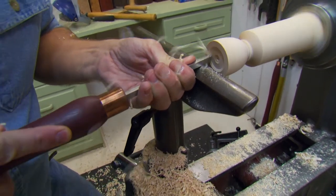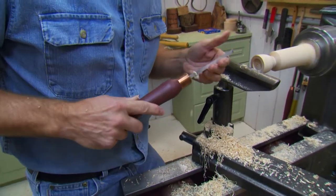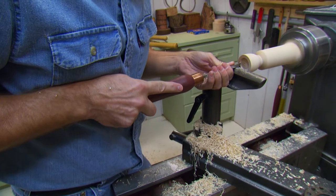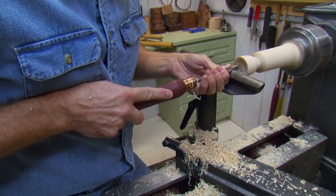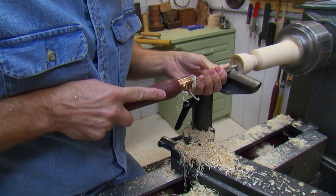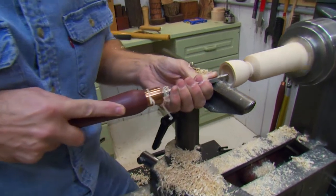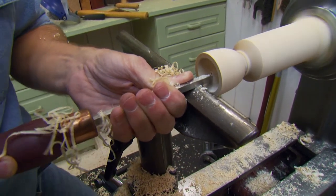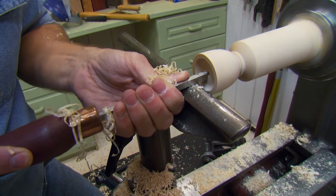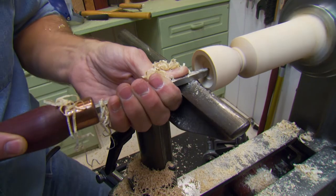If they're making it for themselves, make it one inch and one-eighth. It's just a very gentle movement. We're only going to go down in here about an inch and a quarter to an inch and a half — any deeper than that takes a different skill set and for a beginner it's a little too deep. I'll hollow this out and then we'll move on to the handle.